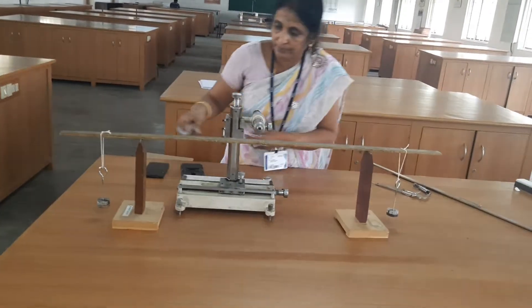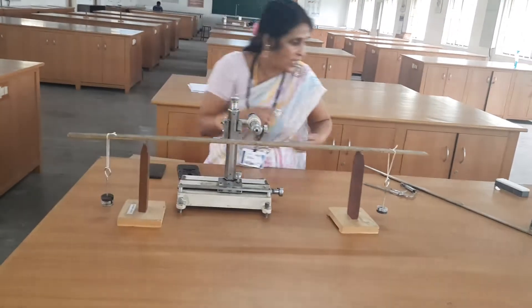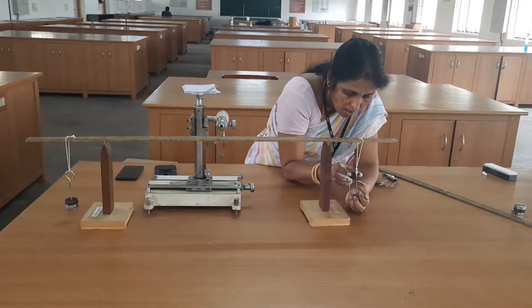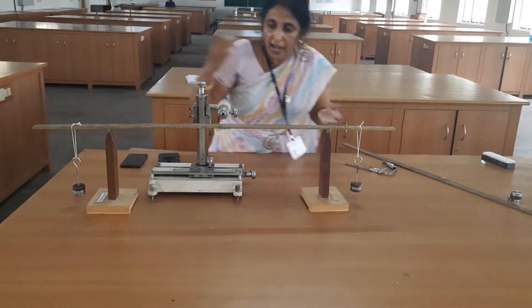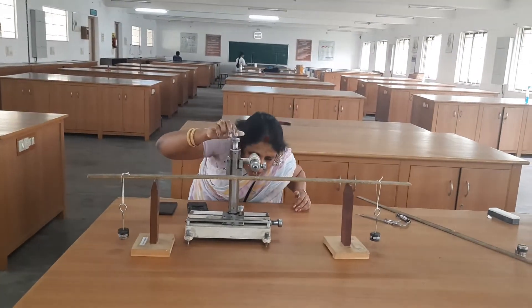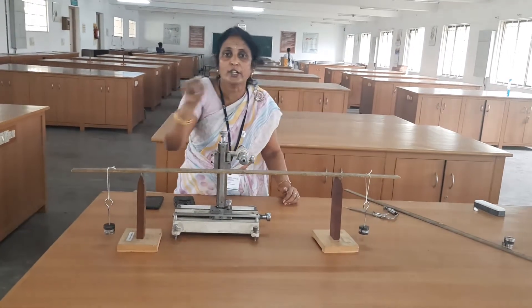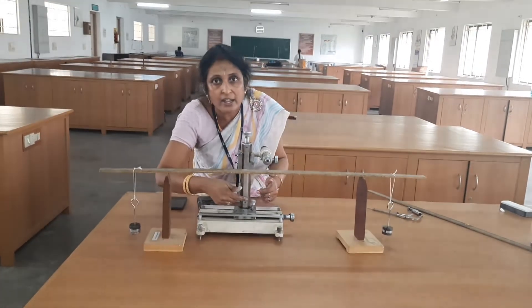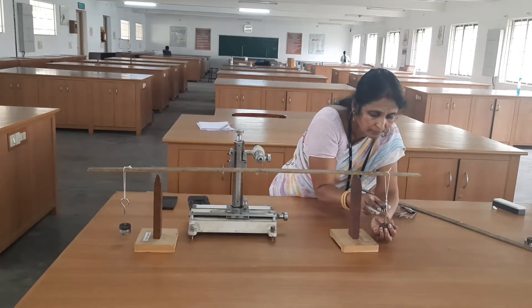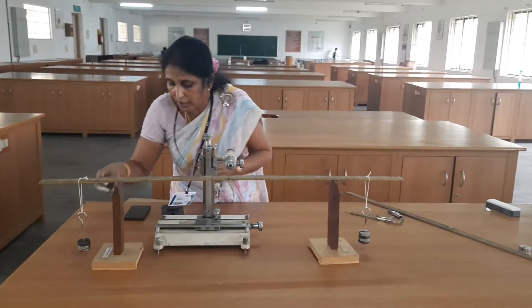Like this, adding 50 gram at a time — now 150 gram. Again pin tip elevates, but when you view through the microscope it will come downward. I have to adjust the leading screw and make the pin tip coincide with the horizontal line of the crossbar, take the reading, and then add another 50 gram — now 200 gram.